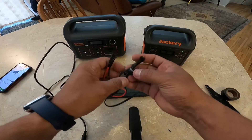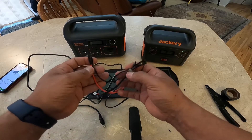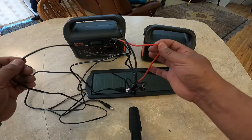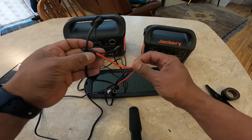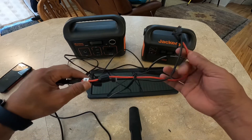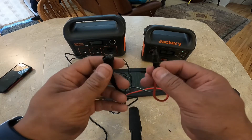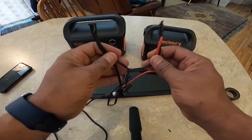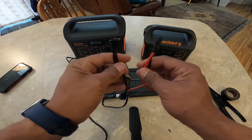Remember, I'm going to go back and clean it up — put some metal wire connectors on here. The black and white wire is your positive. Red from the adapter is also positive, and it should be marked anyway. So red goes with the black and white wire. Don't just leave it like this — clean it up, put some metal connectors on where they connect together, then throw some electrical tape or shrink wrap cable coverings on here too.